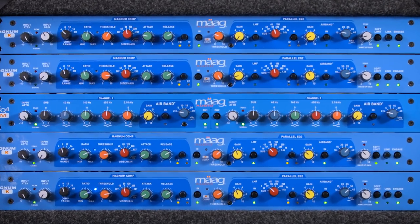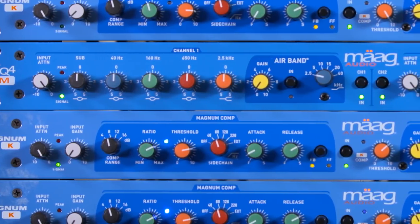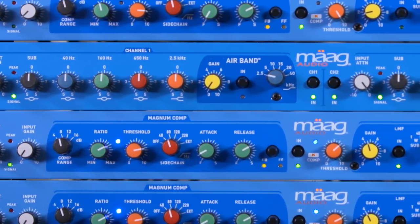Then I thought: I need a circuit that will automatically control pulling that gain down on that bandpass, like I was turning it down manually. So we decided to build a compressor that controlled the 2.5k. We modified an EQ3 circuit board and put that control circuit on it to pull that gain down and control the harshness so that it wouldn't hurt your ears.